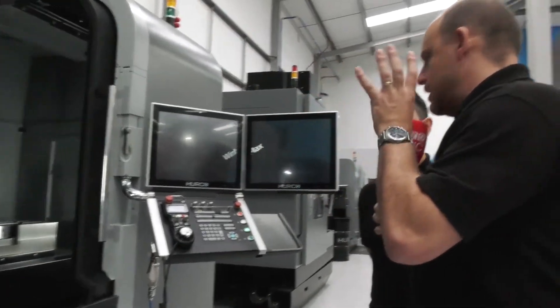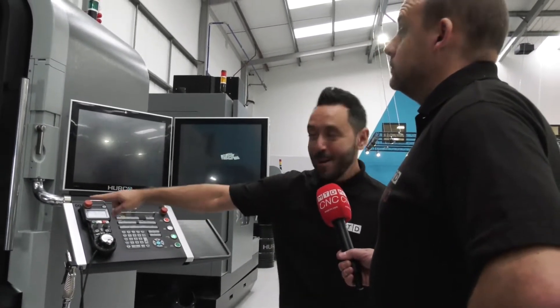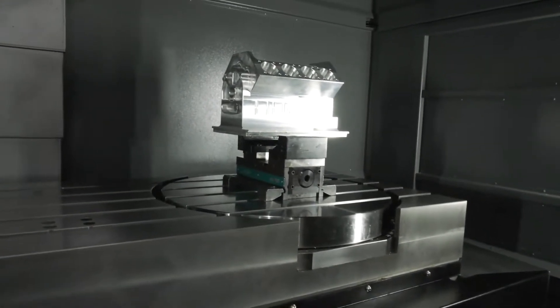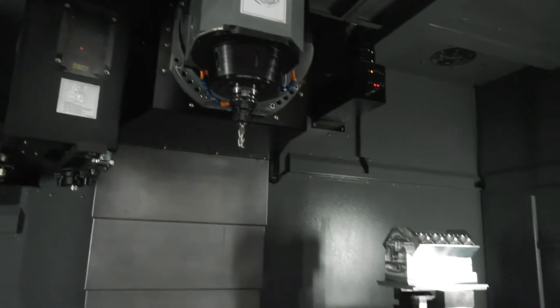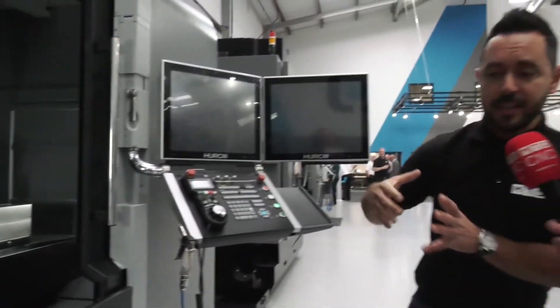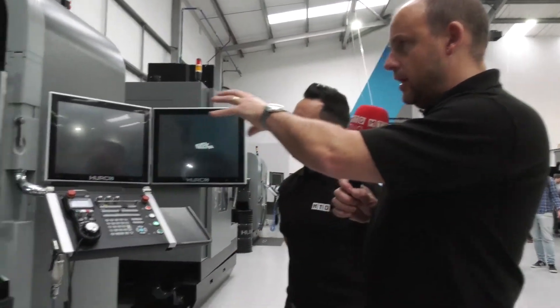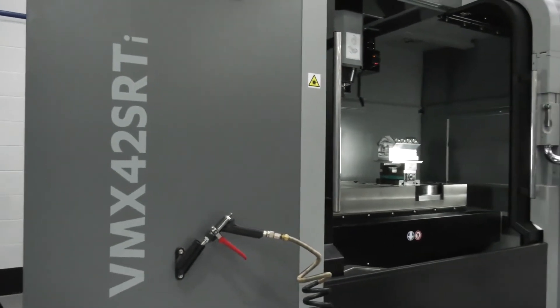For me this is as flexible as you can get with a 5-axis solution. You could also use it like a horizontal — put a tombstone on the rotating table mounted in the middle of the machine bed, tilt your head at 90 degrees and use it as a horizontal machine. You could accommodate 10 or 20 parts per face of the tombstone, and if a particular component also required a 5-axis feature, you can hit that feature with the tilting head. You get ultimate flexibility if you've got the floor space and don't know what's coming through the door. Full 5-axis simultaneous is available, with full 5-face machining and a big working envelope.